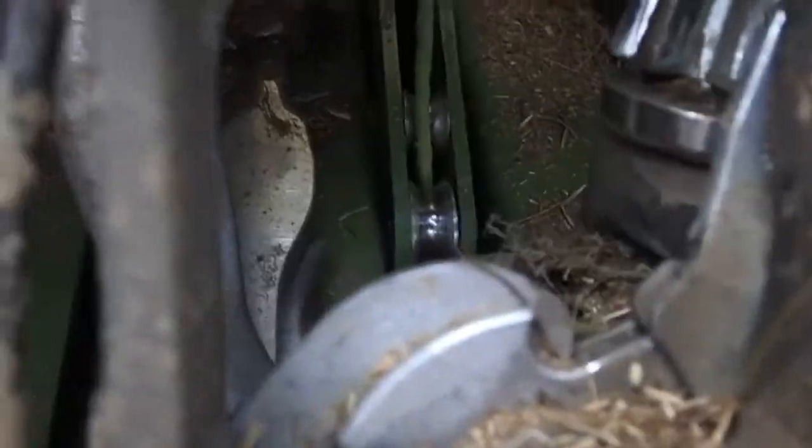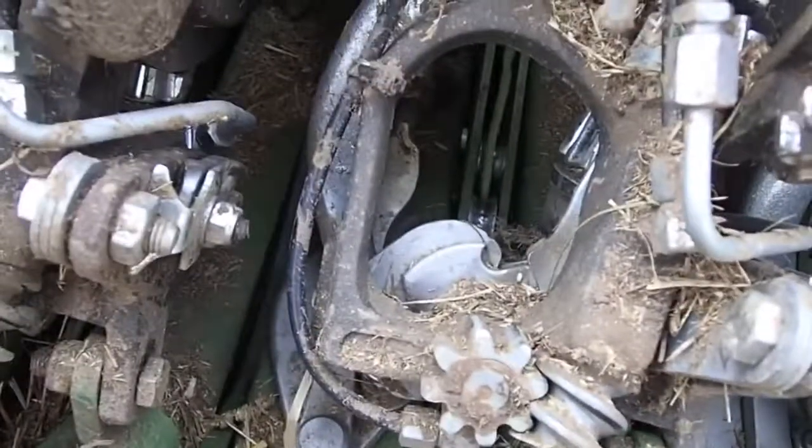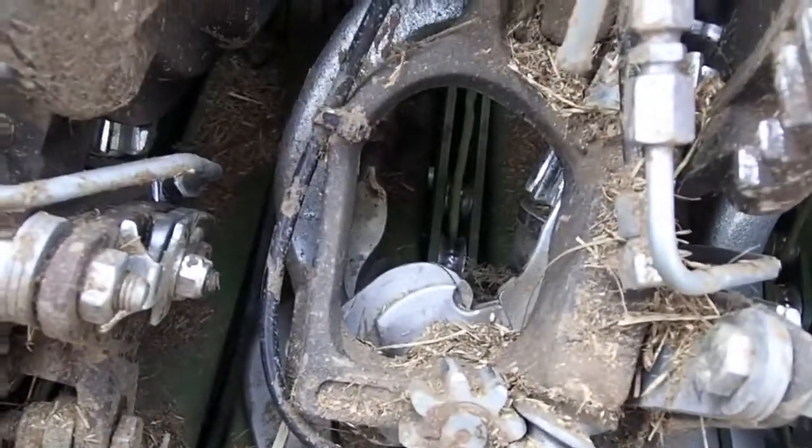You stick it down between there. And because the bale's already busted, it doesn't much make any difference. So as you can see, that string is down between those rollers, and when the next slice of hay comes up, the plunger will push the hay against that twine, grabbing it, and then it'll start the cycle and pull that string through. So you're not fishing twine through here, trying to figure out how you're going to get it tied up back here, making a whole mess.